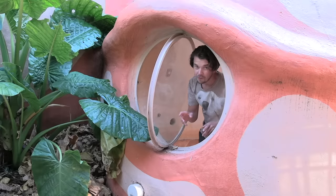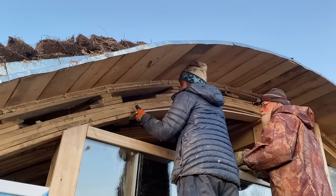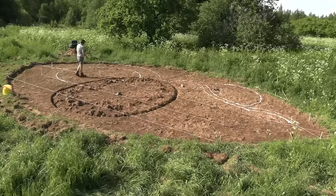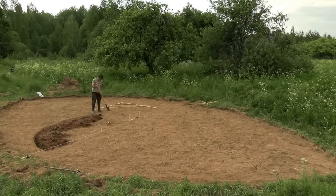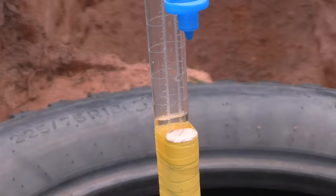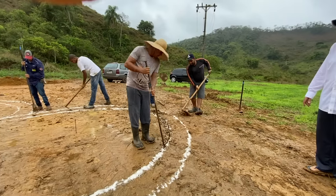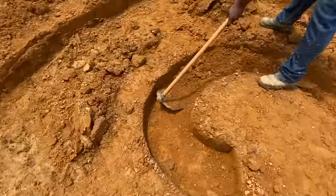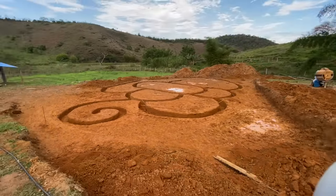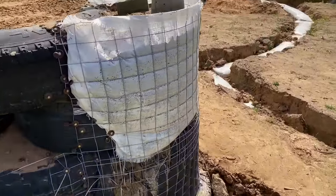With these step-by-step video instructions I hope to inspire you on how I built this waterproof and insulated robust vault. I will show you how to transfer complex geometries from a paper sketch or CAD drawing, how to prepare the ground and how to dig a level foundation using a water level and simple tools. You will see how to dig in sandy soils as well as hardcore clays using basic shovels and hoes. To explain the construction of the foundation I will teach using my Brazilian build, my Siberian build as well as the one on my own land in cold climate.